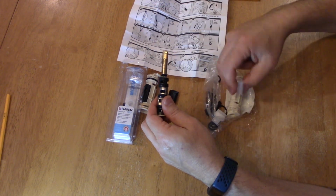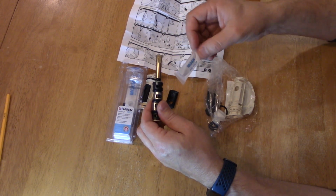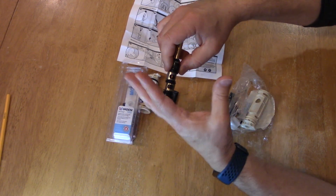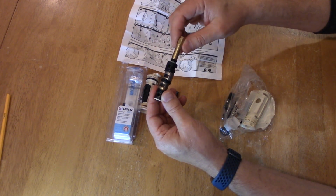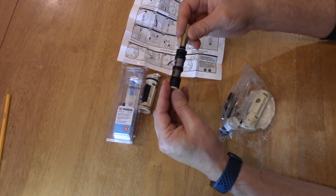And if you don't want to use this lube, another thing I use that works really well is just petroleum jelly, like Vaseline or something, and just fill it up in there. The water pressure is going to push that out, but it keeps it all nice and the rubber pliable, doesn't harden over the years. But again, keep it in a sandwich bag after you're done.